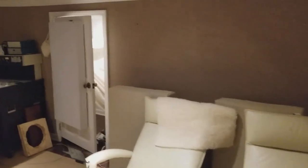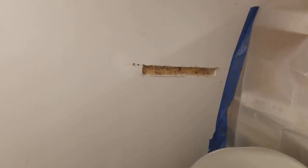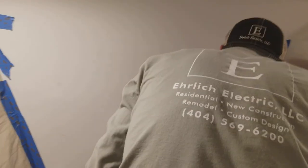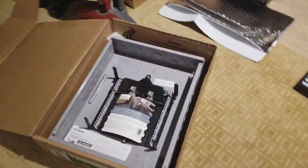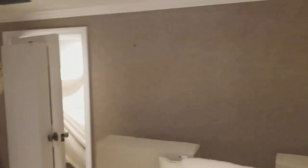We are running on the outside of the house, as you saw, our own feed, which is going to pop in. This is the external wall in here, and this is the whole closet on this end of the room. We're going to pop into the wall right there — this is the outside wall — and we're going to put a new breaker panel right in there, which is this guy right here. So we'll have our own feed direct over to this wall, and there will be completely isolated power from the rest of the house.